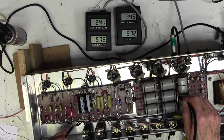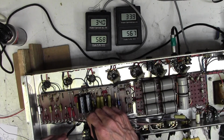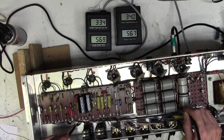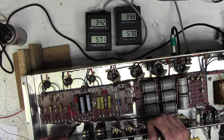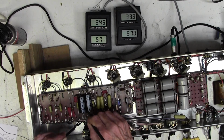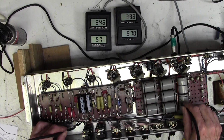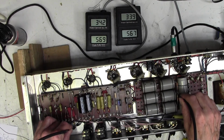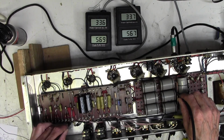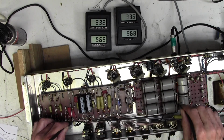It's interesting now going to here. This tag, remember that tag didn't do anything before, but now we've grounded this one. But not to here, it needs to go back to here. Wow. Doesn't that show you what earth loops are like? We've got a huge thick wire going from here to here, but when I go here, it doesn't reduce it significantly. When I go back to here, it does. Wow. That is extraordinary. But doesn't have any effect here. Ha ha. Wow, wow, wow.